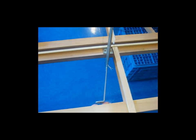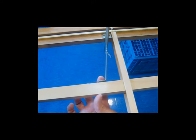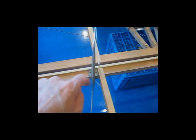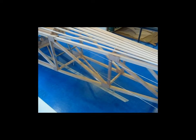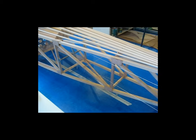This space here is going to be for my 1/8-inch plywood, and I'll probably put another piece of 1/16-inch plywood on this side for the bolt to go through, plus plywood on either side for these bolt holes. That's the method I'm going to use initially — just string to check alignments and make sure the cables won't rub on the fuselage.